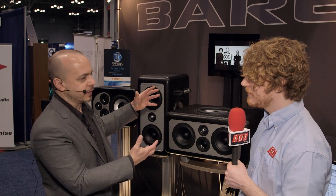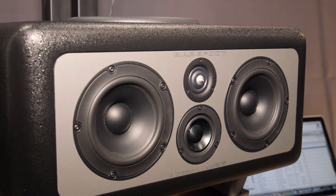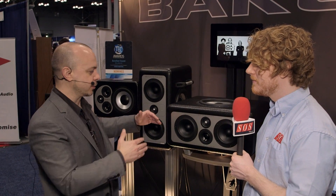So you have all this energy — relatively up in your face if you're using them as near fields — but the energy is extremely well controlled. The cabinets are rock solid; there are no vibrations being emitted from the subs. Those cross over at 100 Hz to the woofers, and it's the same woofers that are in the MM27. Every driver is built to work beyond the range I actually use it in — these woofers can actually go flat out to 10 kHz. That's why in the MM27, with the mix cube emulation, it's only the one bottom mid-bass, and that is working as if it were a full-range mix cube. But in the MM26 these are sequestered down — they only go up to 600 Hz and then cross over to the mid-range.